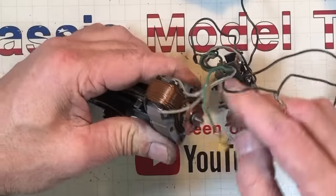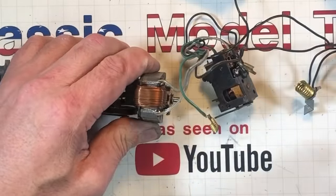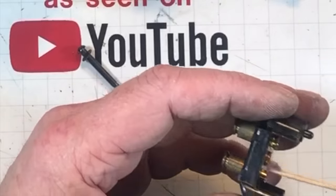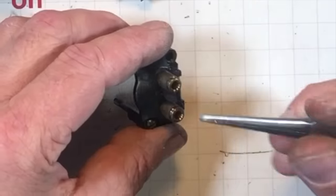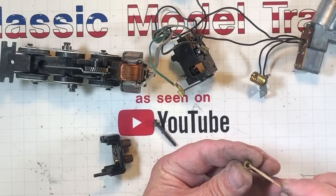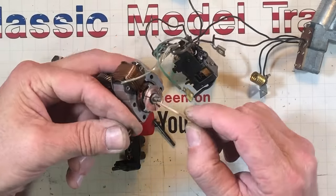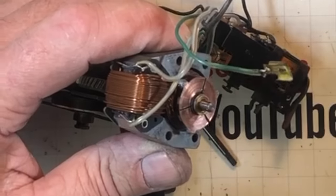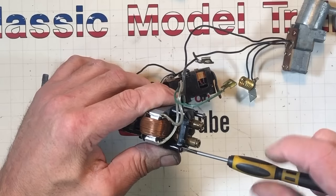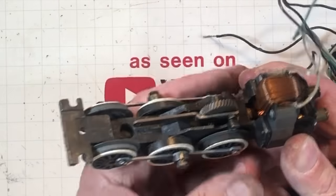Put our rotor electromagnet in. These wires were going towards the back, so we know that we get that on right. A brush holder, plus I just want to put a little bit of grease back over here. Plus this did have a wick for putting a little oil in to keep this back armature oiled up. Another thrust washer here, it's also going on the back of the motor, right up there. Just some. Yeah, that looks good. Because we can't turn our motor, not at all.